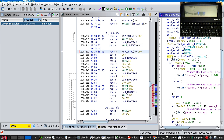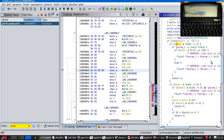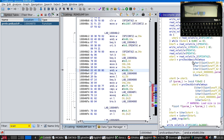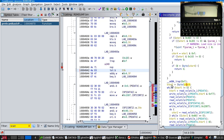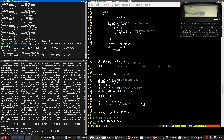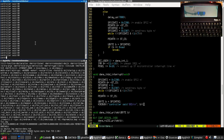So we seem to be getting WVAR1, and it's then setting bits in the return parameter, I think, to tell you maybe what kind of event it is. And then we read another byte. Yeah, I think that's how it works. Okay, let's execute this and see what it does. It may just spam us with gibberish. Zeros. Okay, let's... Oh-ho! Right. I am going to guess that this is a sequence of key pressed command and then the scan code.